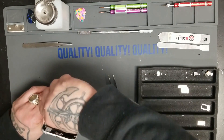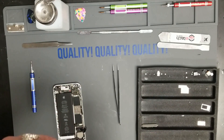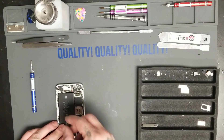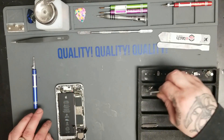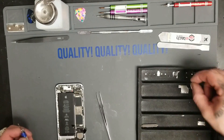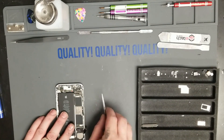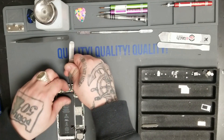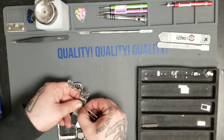I'm going to take a look at the camera — this is one of my favorite repairs. It's very in-depth; you get a good feel for the phone. I've probably done 300 of these in the last few years and it definitely gets easier. If you're worried about remembering how everything's laid out, do a few water damage repairs and you'll get it down very quick. The antenna's loose — keep it with the rest. Always remember to get that last screw; it's kind of an oddball. Never force the board out; if you feel like something's grabbing, there's something grabbing. There's an antenna here that's actually weaving underneath the board and on top of the board, held in by little metal pins. Make sure you get that out. And we have a free board.